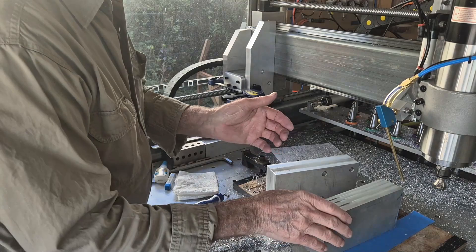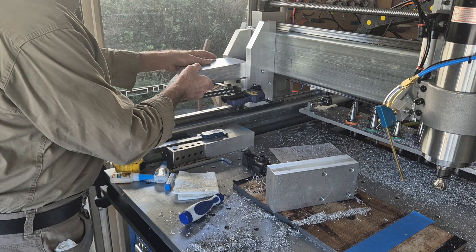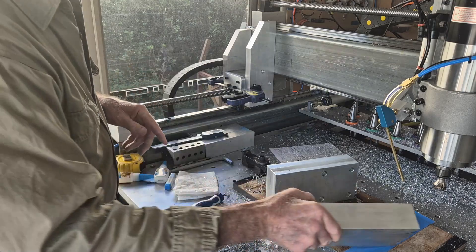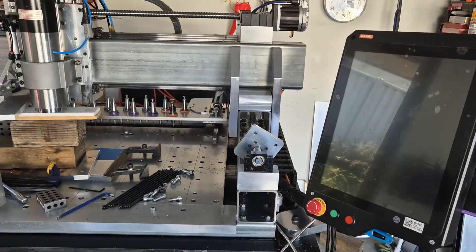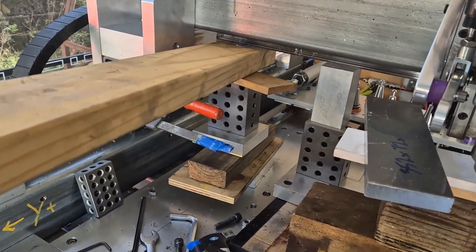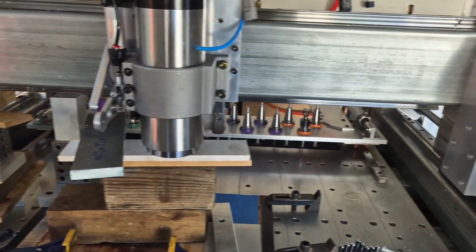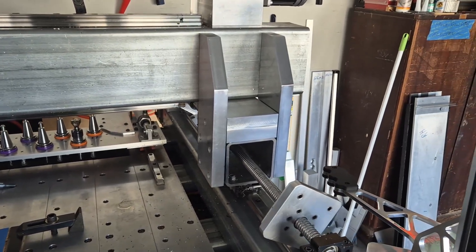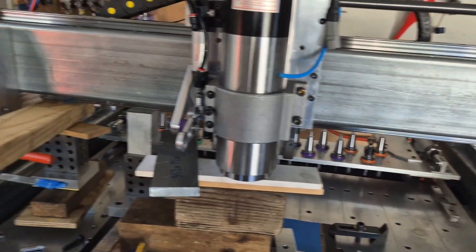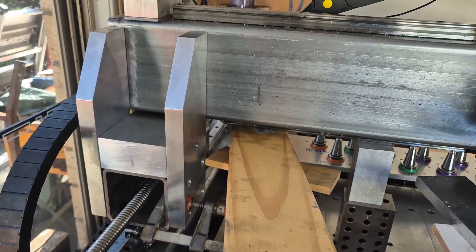Just trialling the fit of this riser block - oh, that is so neat. Raising the gantry 50mm - dead easy. The Egyptians can do it, why can't I? With enough blocks and spacers, just jimmy up one side at a time until I get those 50mm alloy spacer plates in. They're the longer support plates, and the riser blocks sitting in there. Coming along great.